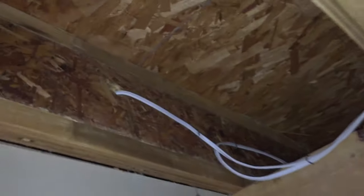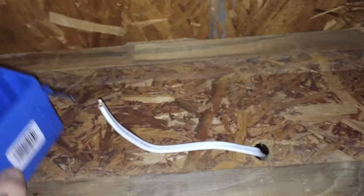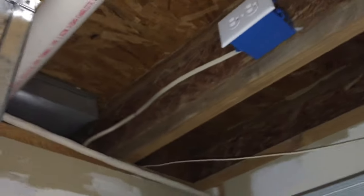Next, I ran the electrical wire up the stud and across the floor joist to a power wire where I could splice it in. This is the desired wire — it's on the breaker for the other outlets for the basement. I spliced it in and buttoned it up. Now it's time to move on to the outlet for the projector. This is the room behind the projector. I installed an outlet there, so when the power cord comes through the wall behind the projector, it will reach this outlet and it'll be nice and clean. The outlets are installed and we are good to go for power.